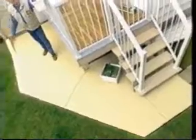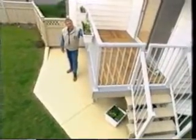And here's the finished product here on top of the new plywood. A tip here, always apply your base coat and your top coat at 100 square feet per gallon. Here we are back on the fiberglass recoated deck. The homeowners put up the new pro-built do-it-yourself railing. Doesn't it add a new dimension to the house? Well, the concrete's finished and it's all cured, and it looks great, doesn't it? It's going to be a lot easier to keep clean as well.